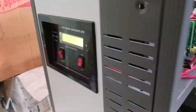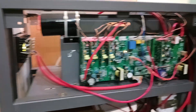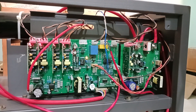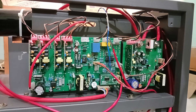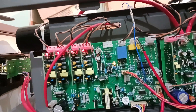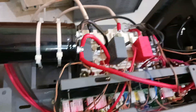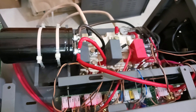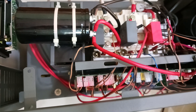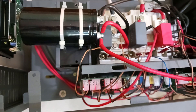So currently the inverter will show you the inside — how the wiring is done and what boards we have used. This is our own high-power inverter board, which has four dedicated gate drivers for the IGBTs. You can see the IGBT here, along with the DC link capacitor, the PFC input filter, and the EMC filter IGBTs etc.